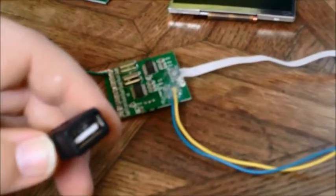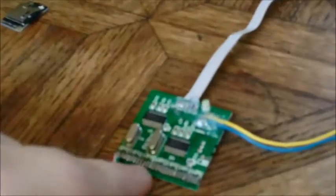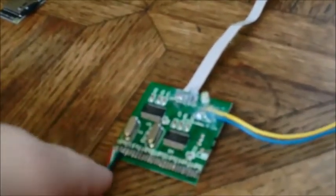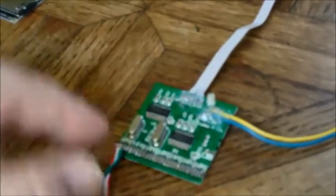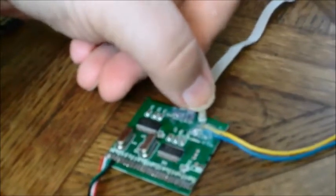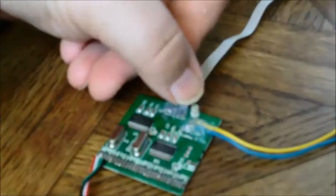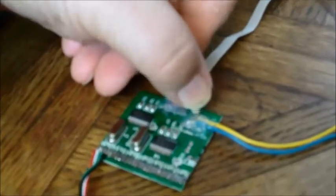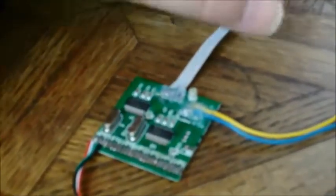As for the hub — you've probably seen pictures of those octopus hubs. They come with this port on one end and the opposite on the other. This particular one is a seven-port; as you can see there are basically enough for four times seven conductors, which means seven USB ports. Here's the input. It did not have an LED on it by default — this LED is actually the original one from the Game Boy. I'm going to make it so that it's still shining but in a different place, because the LCD is too big.